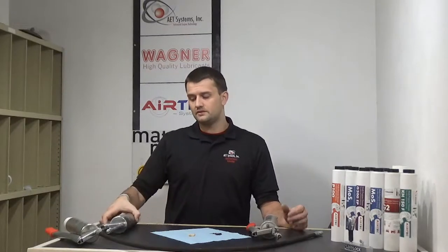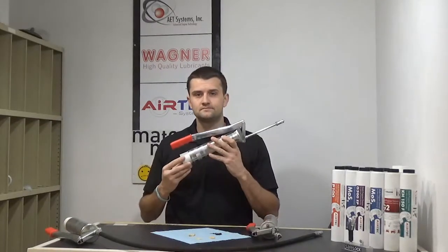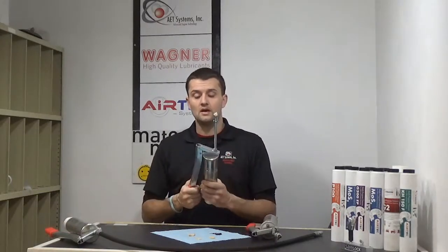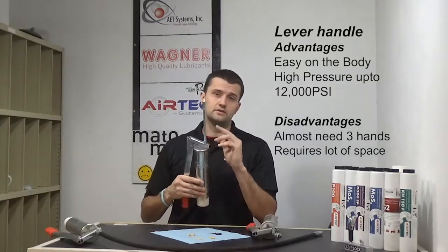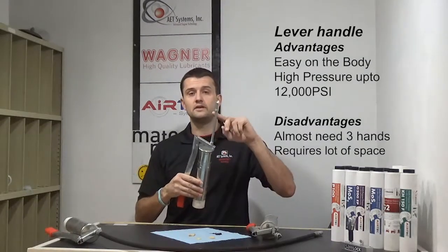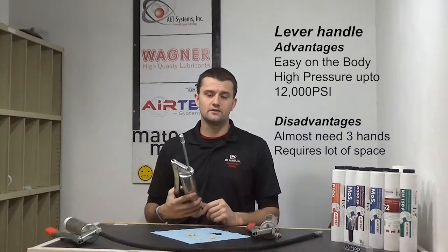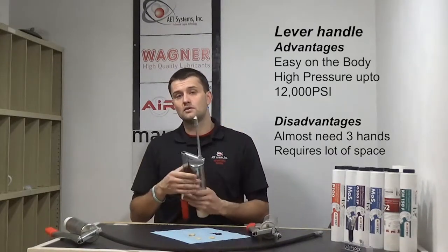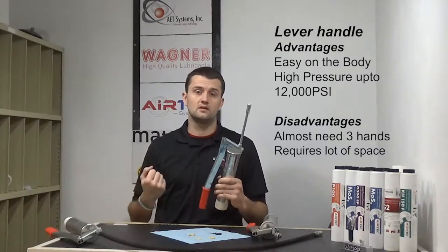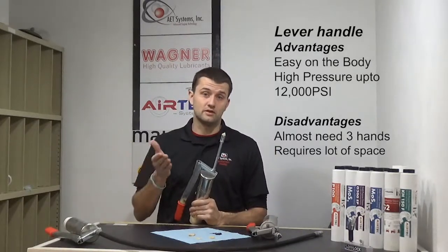In front of me, they're all lever-handled grease guns with some different options on them. The lever-handled gun is probably the most common design and the most popular style of grease gun 10, 15, 20 or more years ago. They're easy to make and easy on your body. The problem is you need three hands to use this if you don't have a rigid tube. And with a rigid tube, you can't always get in where you need to in order to grease a zerk fitting. If the machine has all the zerk fittings out in the open, it's very easy to use. But if you're trying to grease a drive shaft, suspension points, or steering column points on a compact tractor, a flexible tube or hose is going to make it easier — and sometimes make it possible at all — to get to those zerk fittings.